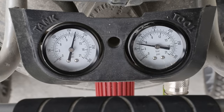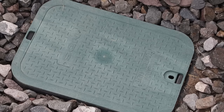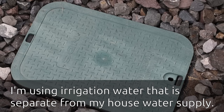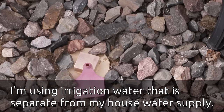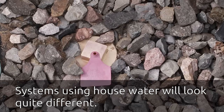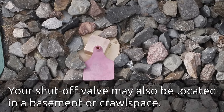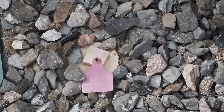That'll be plenty of pressure to blow out the system. Somewhere in your yard you should have an access panel that looks something like this. If you open it up, you'll see inside there's a bunch of different things — valves and knobs. But really close to that, you should also find something that looks about like this. This little cover is the access port to turn off the main water feed for my sprinkler system. Both this little port and the larger box may be located anywhere inside your property — mine happens to be in the backyard.